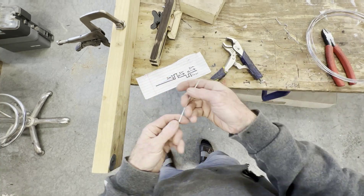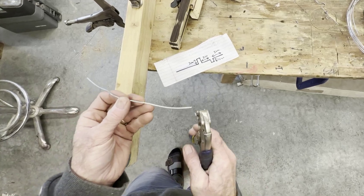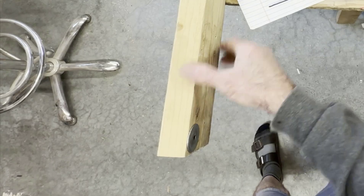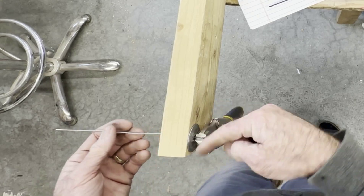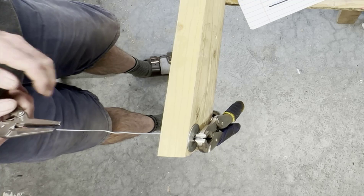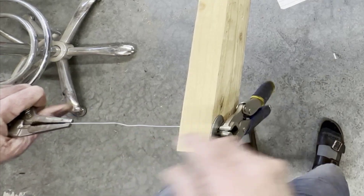I'll make it a little messy but not too much, so it's bent and I need to straighten it. This is the straightener - the straightener is lots of fun. Clamp one end of the wire with a locking plier perpendicular to the wire. This is just a two-by-four clamped onto the table with a hole drilled through it and a washer there - the washer keeps the wood from getting worn down. You could have a washer on the other side for lefties, so one person can do this side and one person the other.